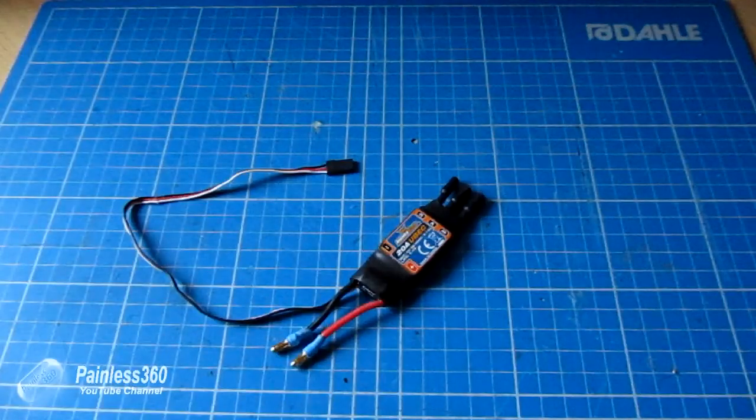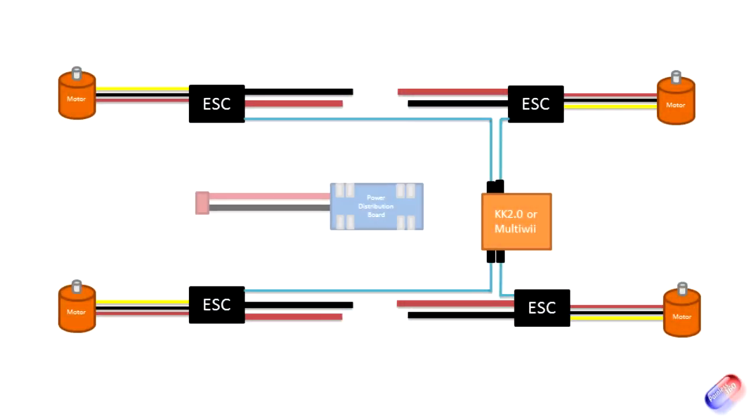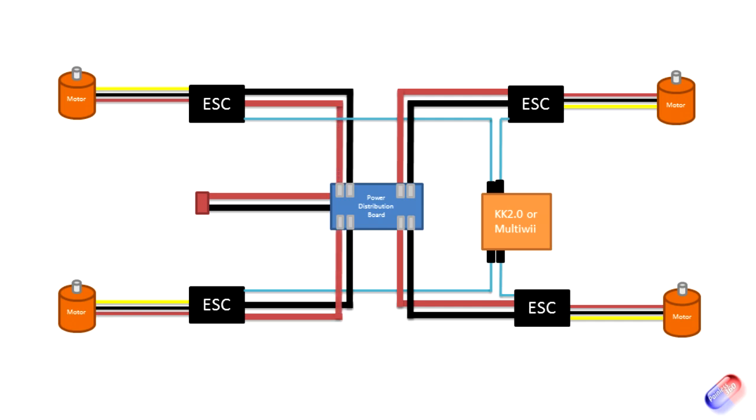So with that being said, let's do the power system. We'll put the power distribution board in the middle — it'll either have solder pads that you solder directly to, though I'm not a big fan of those because when you have to swap out components you have to get the soldering iron out. I prefer the ones that have little 3.5mm bullet connectors on them. With those bullet connectors you can very easily just plug in each of the power leads into the corresponding connectors on the power distribution board — red wires to the pluses, black wires to the minuses. Then outside you have the flying lead from the power distribution board that you plug the battery into.